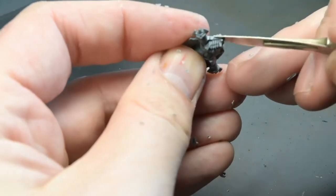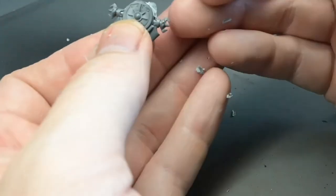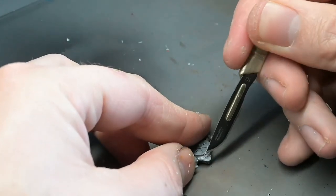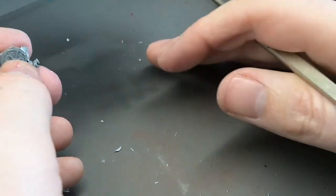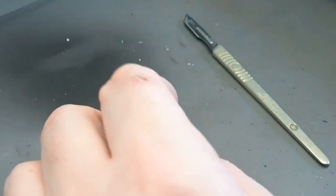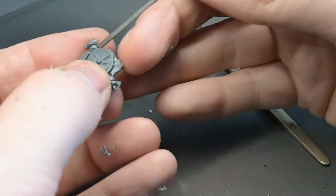The larger or thicker the part that you want to cut, the more pressure you're going to have to put on the plastic, and that's where you start slipping. If you cut slithers every time, they come really, really quickly, because like we were saying when we were clipping, the pressure you're putting on creates stress through the plastic. If you're cutting a slither, the plastic is stressed very quickly, so it cuts very simply.